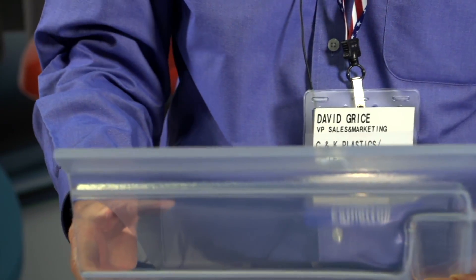The result is a part that's homogeneously bonded together with no parting line — it's a very, very rigid part. This one is cut in half; it's a window for an ice machine, so you can see the inner walls. There's 30% less plastic in this than the previous method. We make roofs for ATVs, parts for ice bins, ice machines, and pallets. Many pallets are made by the twin sheet process because you can use thinner sheets of plastic, save weight, and make a more rigid product.